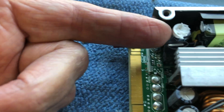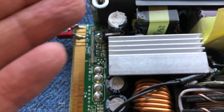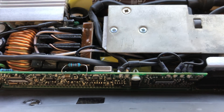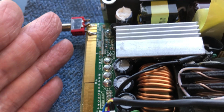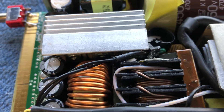Think about it — you had your sensor out here with the fan pulling. As you're pulling in cold air, this sensor is never going to get hot enough to turn this fan up in case the board gets hot. It's never going to work. But even at idle with the fan turned around, you can feel air coming out the back. And then when you start getting some heat, it's going to turn on and ramp up and get your board cooled down quicker.